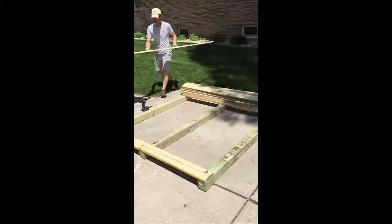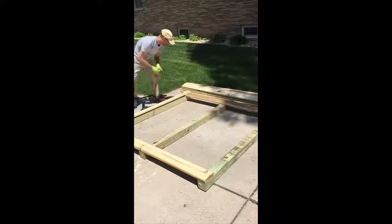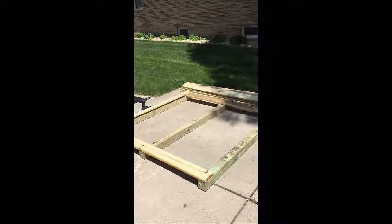Now I'm going to lay a 1x4 across one side. When everything is put together, there will be a board holding down the stage floor at each end. I square up the board and mark each end with the same number as the deck board beneath it.